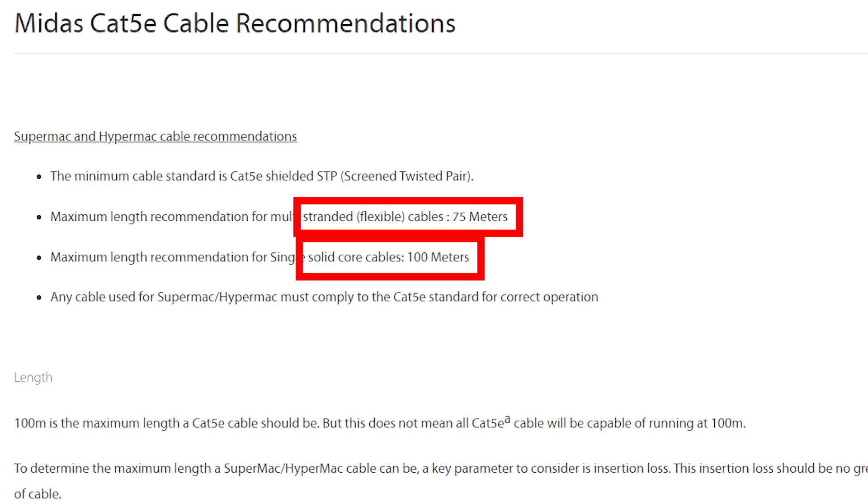There's another dynamic too. The cables that work best for AES-50 — what they recommend for extra long lengths — are solid conductor wires. But if you have a portable sound system, the last thing you want is a convoluted slinky to wind at 2 a.m. during load-out. We need something that winds well, is reliable, works every time for these interconnects, and is durable.